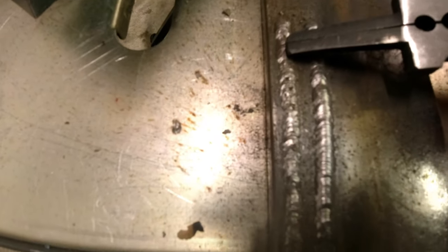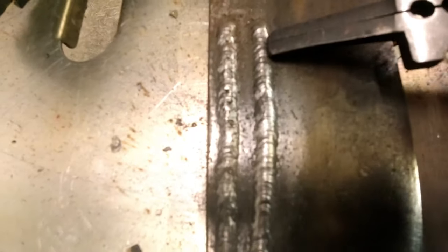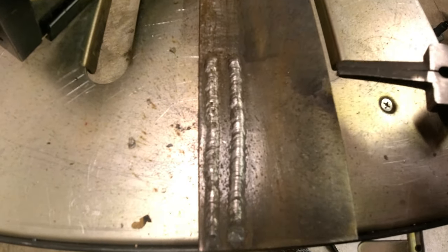Here I was barely an eighth of an inch — you can see that the gas in the center of the rod didn't get a chance to shield the weld. The flux in the center of the rod shields the weld from outside contaminants. Where I kept about half to five-eighths it looks clean. Where I was about an eighth of an inch, you can see the little pits and holes — that's from losing shielding, causing porosity. It makes for a bad weld.